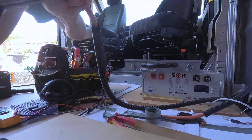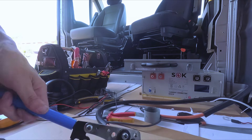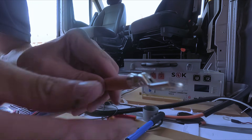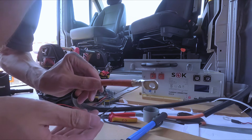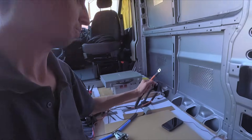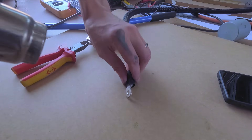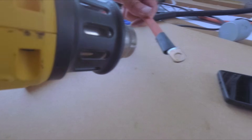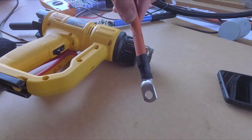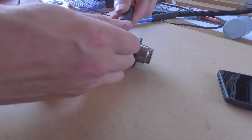I think I can do this in three goes. Let's see. Yeah, that's fine. If you look at that now, it's got no weird extruded horrible bit — it's just really nicely on there. And then to finish these all off nicely, I'm adding some heat shrink, because heat shrink makes electrical things automatically ten times better. This is nice dual wall stuff with adhesive inside it. Wait for that to cool, then I'm going to add another layer.